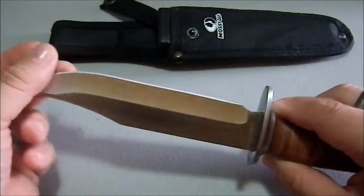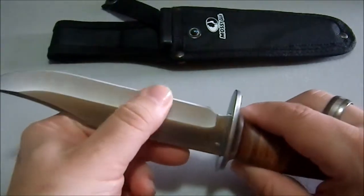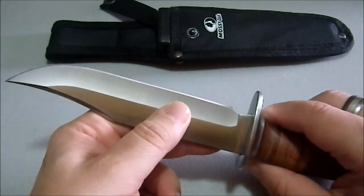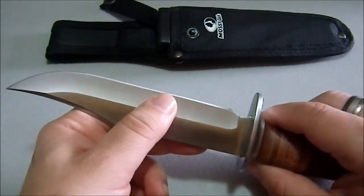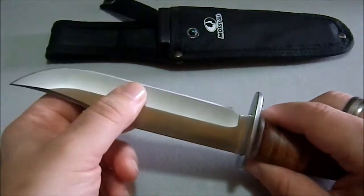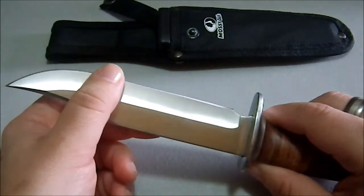It's hollow ground, which is not my favorite. I know there are lots of people that like hollow grinds, but I prefer a flat grind or a convex grind — I think both cut better. I think hollow grinds are overrated; they're excellent for straight razors, but for everyday utility they're a problem because when cutting through material they act as a wedge as opposed to pushing material aside, like the bow of a ship pushing water out of the way.